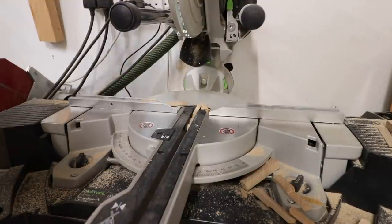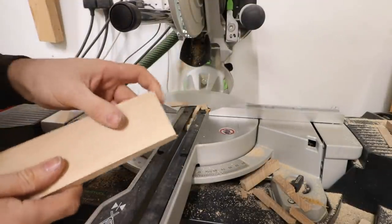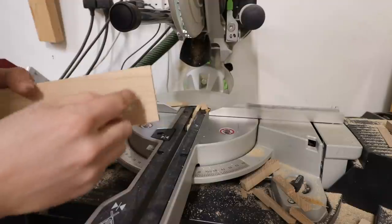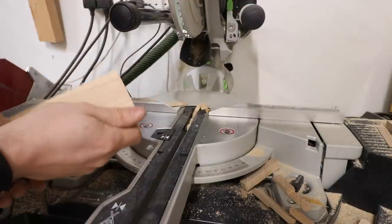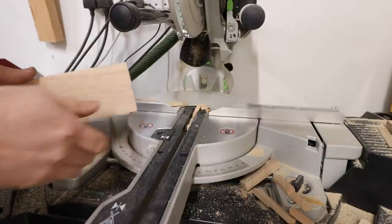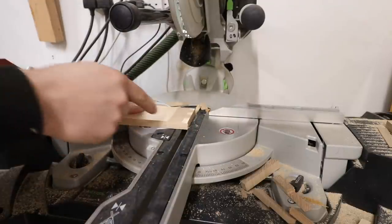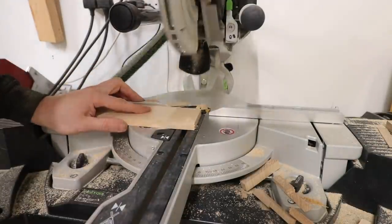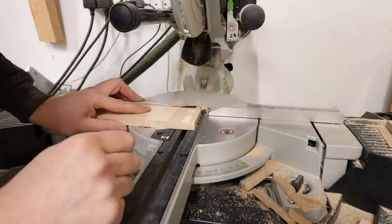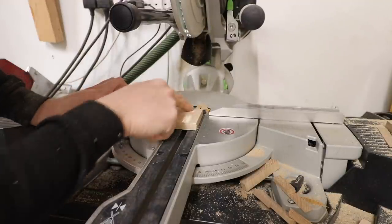Just a note, while I've got the saw set up, you can make a massive difference to the quality of the finish by how you use a crosscut saw. A lot of people use a zero clearance insert to get a nice cut on the back, but they're only great for a few cuts, and then you start getting a bit of rounding on the insert, and then you start getting breakout. So what I tend to do with sliding my saw like this, instead of just blasting through from the front, or blasting through for a start and then pulling it forward, is run a score cut along the top of the piece of timber,